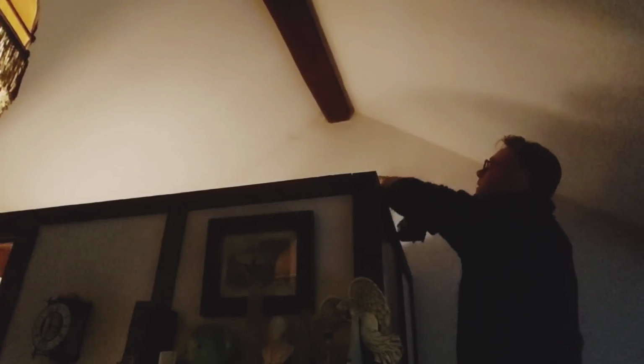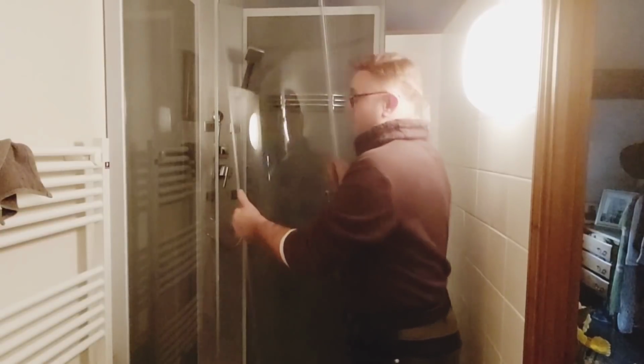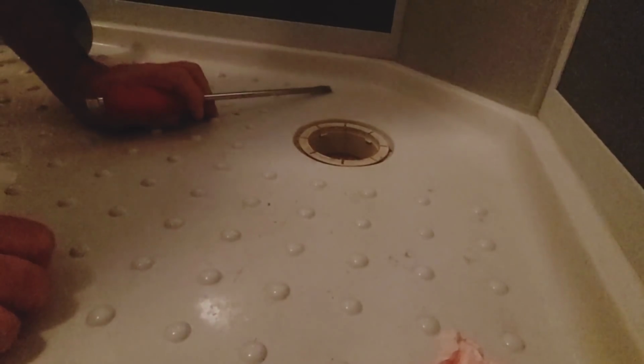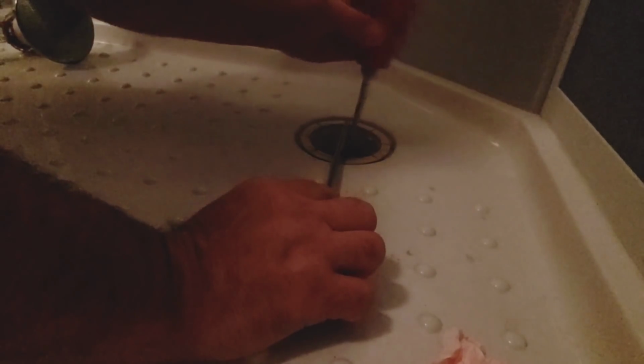I'm just on top of the shower now, and I didn't put the shower in, but there's a couple of L brackets here and here, so we're just going to take those out and then slide the whole shower back that way to access the pipework. Sealant strip here. Just take these screens off. Okay, we just need to get the waste out. So, a little collar in there.